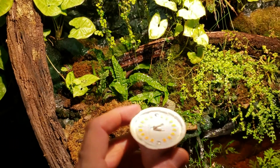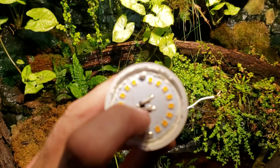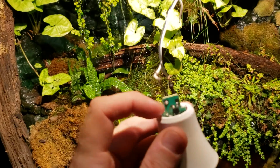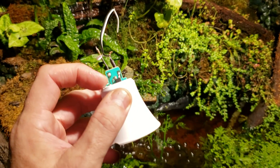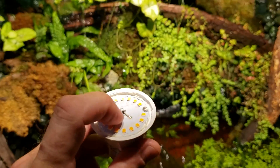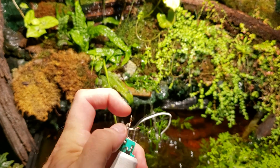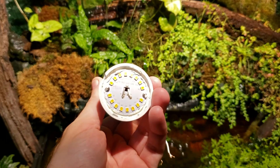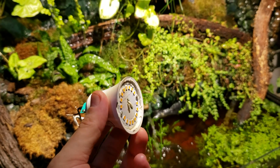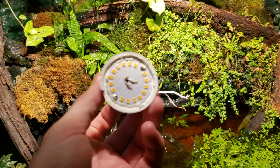This is significant: on the 2700K you can see where the two leads are soldered to the face of the chip and attached to the internal components. On the 5000K they're just two metal points that stick out and aren't attached to anything. So when you break the base end off on the 2700K, the wires are attached to the metal contacts and get pulled right out of the chip face — it no longer works. A couple of times I tried to reinsert them, heard a loud pop, and smelled smoke. Both went in the trash.